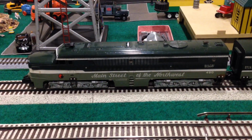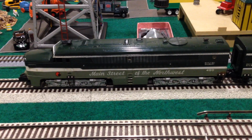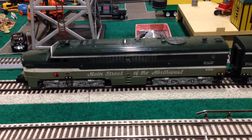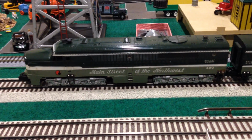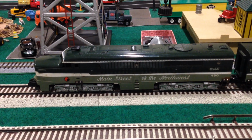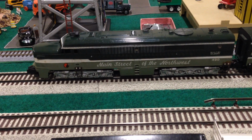So he approved getting the two power trucks bushed, and you do them in pairs also. You wouldn't just do one or the other, the front or the back. So they were bushed and rebuilt, and now arguably better than new. Certainly now to last for a while if they are properly maintained with the right kind and right frequency of lubrication. It runs well now, certainly quietly, and stays arguably the coolest of the three after a good period of running, as one would expect.